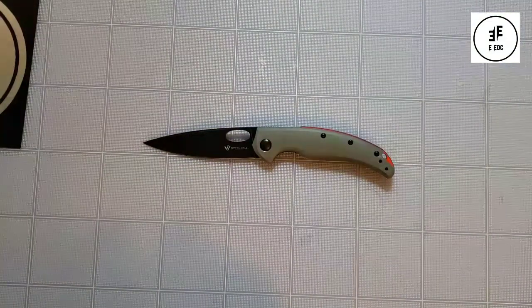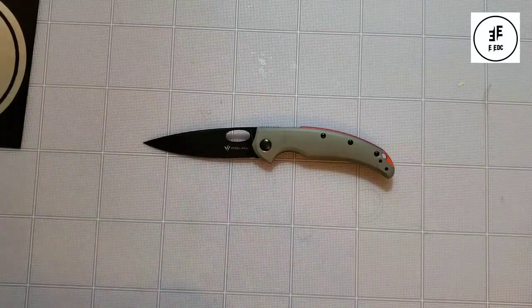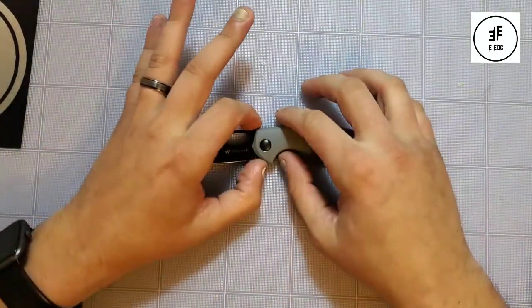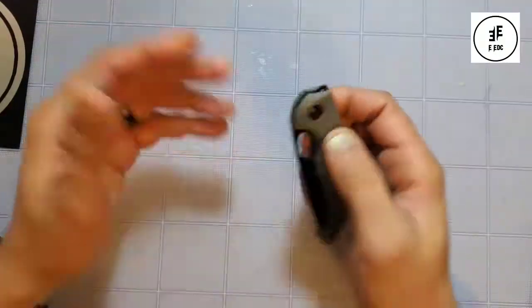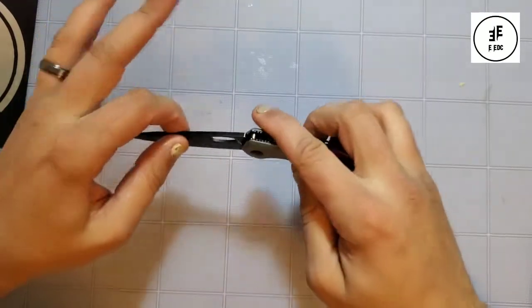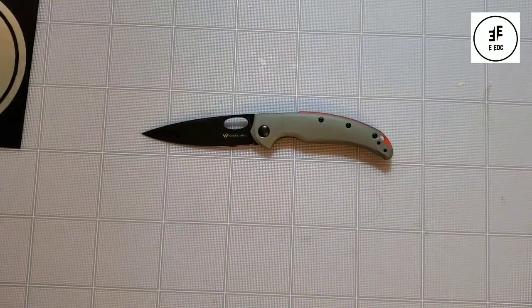I think I pinched that corner, and it created like a burr on that washer, a very visible burr, which caused one side of the blade to erode quicker than the other as I'm fidgeting with it, which created room for blade play, and it created a really bad action. Is that a fault in this knife? I don't think so. You just have to be careful.